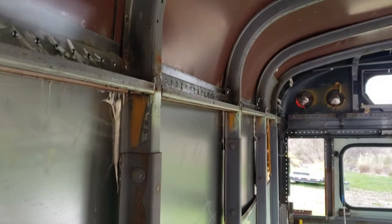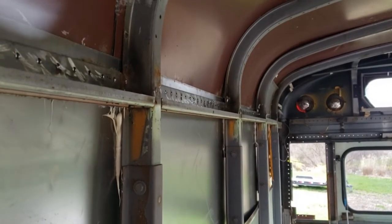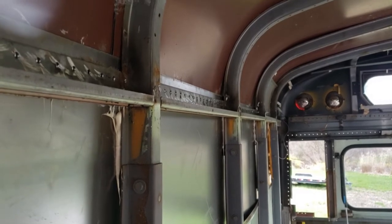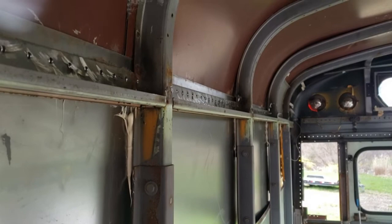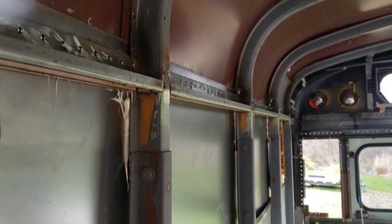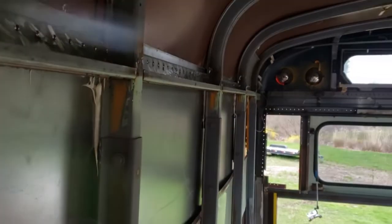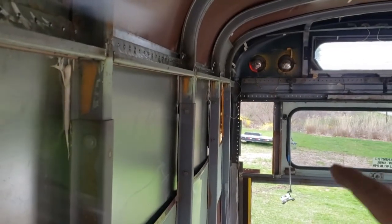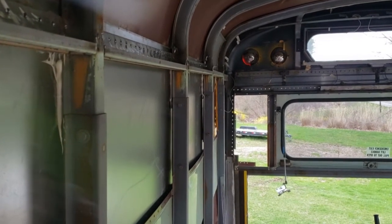Anyhow, that is what I'm doing here. Starting to caulk, and then I'll get the pneumatic riveter and put a row of 1/4-inch rivets. Most of them will have a 1/4-inch grip, except for where the layers are extra thick, like back there on the corner. They're going to have to be 1/2-inch grip rivets. So get at it here.